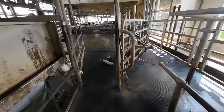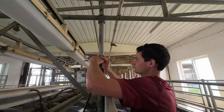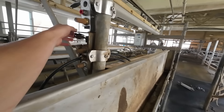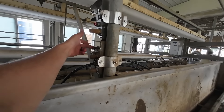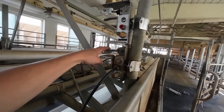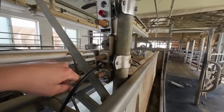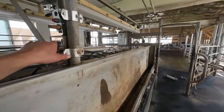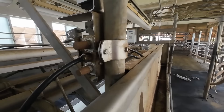First thing I'm going to do this morning is put this new valve on. I turned the pressure off in the system. What's happening right now is whenever we flip this lever down it just leaks air out of the top — it's like a pressure release. It's not supposed to let air out constantly. First they were thinking the seal is out in the middle of the cylinder and air is passing through, but I don't think that's the problem.